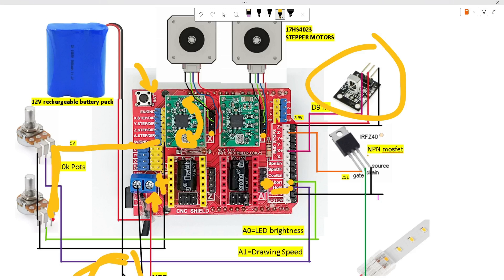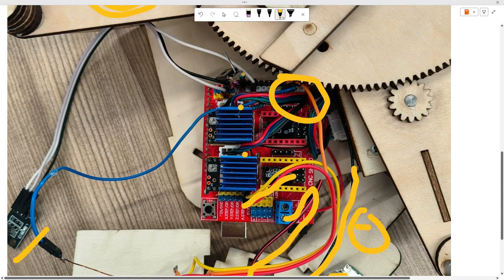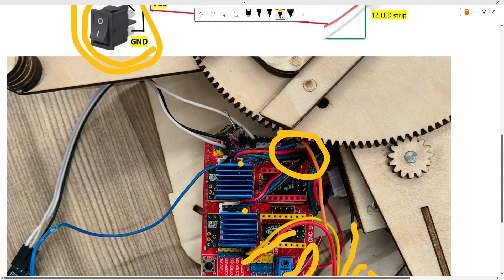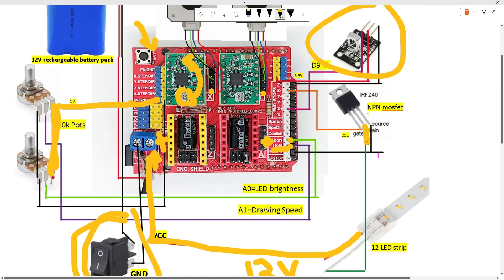Next we have our LED strip and it's controlled by a single MOSFET. You can see my MOSFETs right here — I just plugged the legs in onto the MOSFET. The positive rail of the LED will go to the positive 12 volt rail, then we're just going to break the negative ground so it will go to the drain, and the source will go to ground. The gate is D11, and that connects to Z minus on our CNC board. You can use any kind of ground, and the Z minus pin is right here.